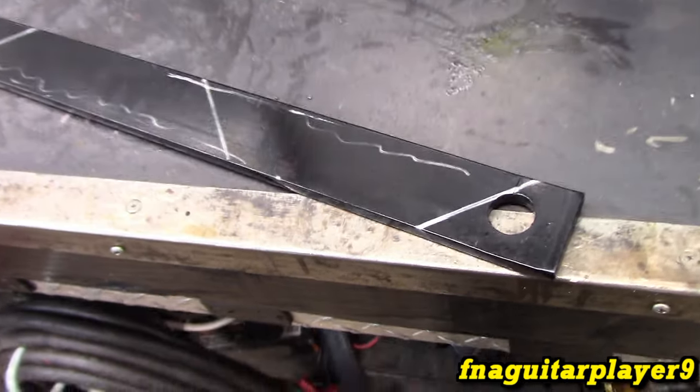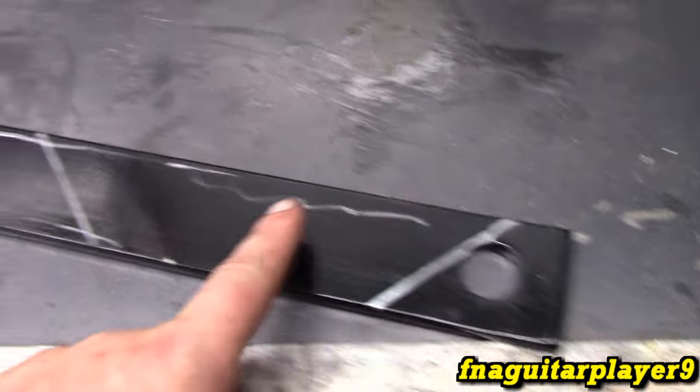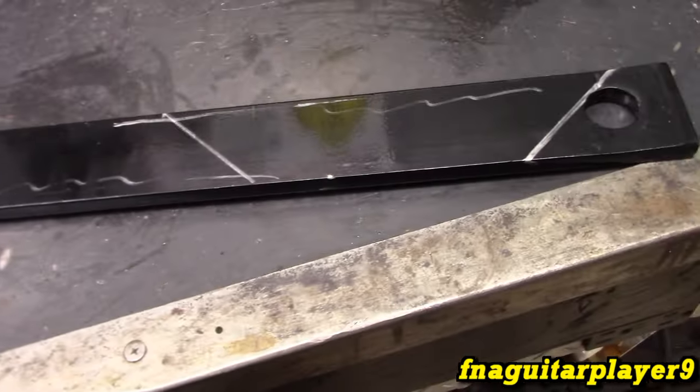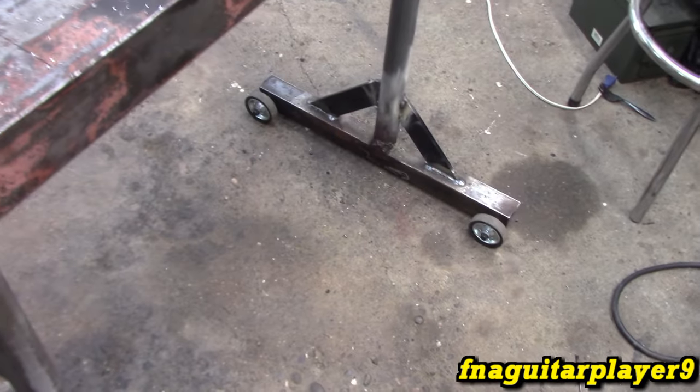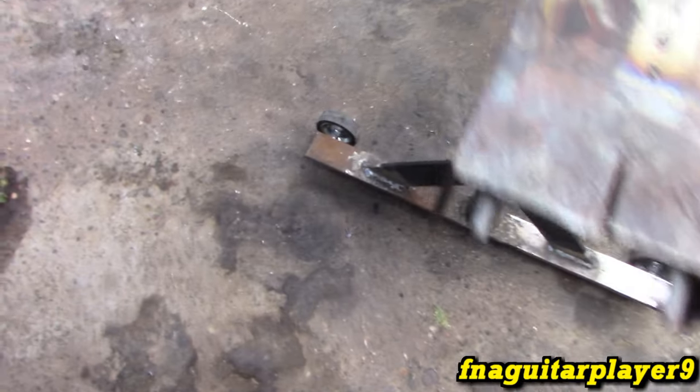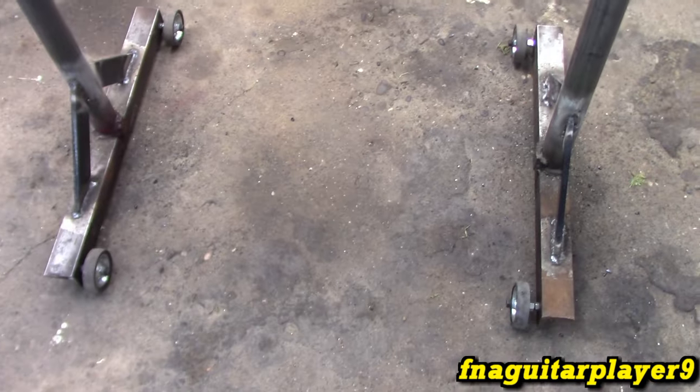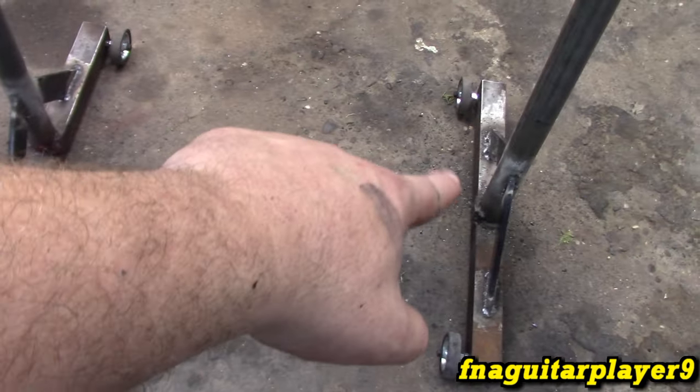Picked up another tractor stabilizer bar arm to make some braces out of. That's 9.5 inches from the widest part on each brace, and since I'm doing 45-degree cuts I'm taking advantage of just needing one cut in between them. These will be the braces for the bottom legs going onto the bottom frame for a little more rigidity. Just put these braces on there - somehow one ended up shorter, but the other three are the same size and it's not critical. Got fairly good welds on them - I'm not good at vertical welds - but they're strong enough. That's just insurance on the stiffness of this; I didn't trust a single weld on the bottom of those pipes.